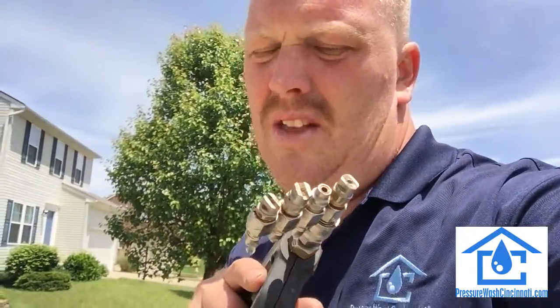The one all the way to the right is a 30-degree fan nozzle, which will not cause you to soap because it's a little bit higher pressure — that'll cause it not to soap too. Last week we had about 300 feet of hose on it and it was still soaping, a little weak, but when you put the 350 on it, it quits. Hey, this is Jason Gaiman with PressureWashCincinnati.com — check us out, subscribe to our channel for more helpful videos, thanks and have an awesome day.